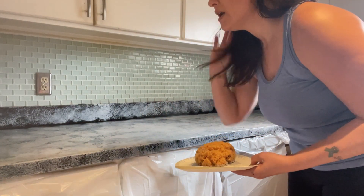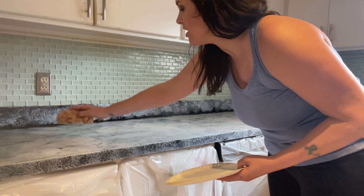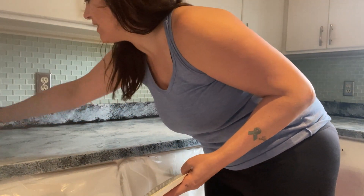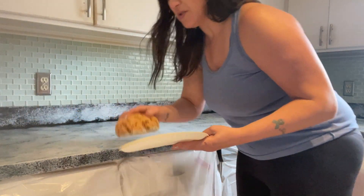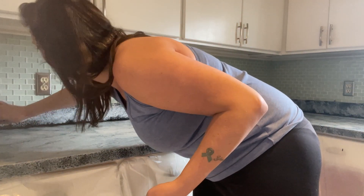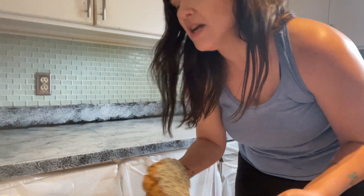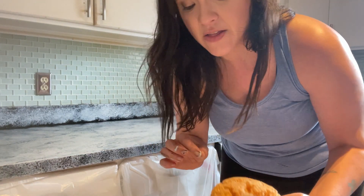My tip with this: there are some areas where you're going to hit a lot more than others and it'll look splotchy, so go very light. Wherever you first hit the paint is going to be the most concentration — you've got to diffuse it all out. Up here on the backsplash part, it can almost look like you've swatched it if you go too fast. You want to keep a dabbing motion so it has the look of the holes in the sponge instead of a swiped motion. Now I need to go back and hit these little small spots down in here where you can't get to them. I'm going to break off a tiny bit of sponge and dab into those small spots to fix it.